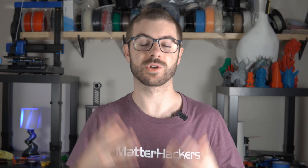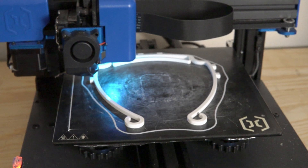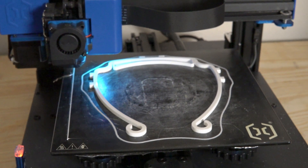This is more relevant for manual bed leveling, but the majority of 3D printers still are manual. For smaller parts it's not as big of a deal, but once you start printing to those outer corners it really matters. I was recently printing PPE face shields to donate to people in need, and they took up a huge portion of the bed. I was quickly able to see the front right was a little loose and turn the knob counterclockwise to raise the bed, ensuring I wasn't wasting material on urgently needed parts.